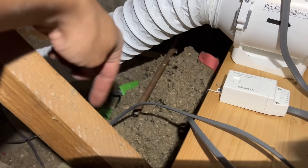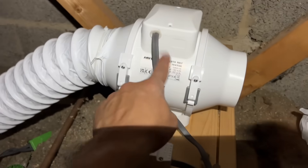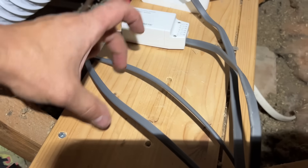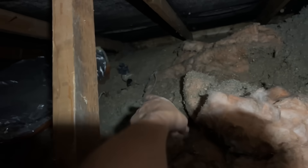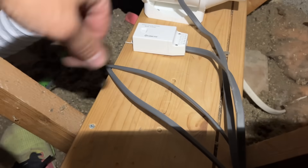Right, a little update — look, there's our fan grill. The builder's going to come and hoover all this crap out and bag it up so it's not going to be filling our lights with crap. There's our kinetic wired up, there's our fan — that's literally going to go out there. They're going to drill a hole straight out there and put a piece of ducting with a flappy grill on the outside. We've got our switch line and our new feed so we're going to put a new RCD spur here, then a Wago XL box — all this will go into it and we'll connect it up. We haven't got a Wago XL yet, so we're going to connect it up outside the Wago and then just click it in. We'll clip all these cables nicely across the beams. The old lights will come out with the old light fittings.